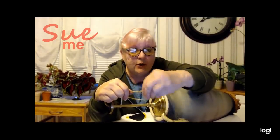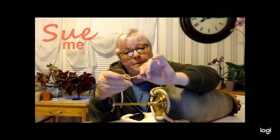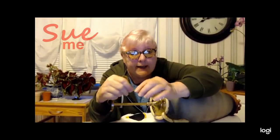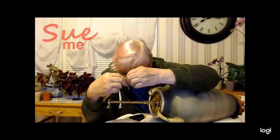And I'm sorry Jocelyn isn't here, because anything involving mouse ears was certain to catch her fancy. Now we're going to wire this. If you look at your wires at home, you'll notice one side is ridged and the other side is not — it's bald like a tire. The ridged side has a little ridge, and you can see it if you look at the sides or feel them. But we're going to keep that tire analogy in mind, because this is how you're going to set up your lamp. You're going to remember — and this is your mnemonic device — the three Bs: bald, black, brass.